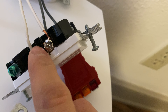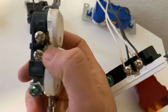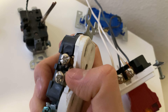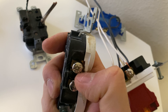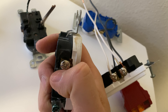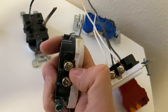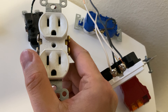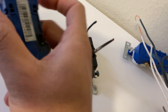When they wire it with the screw and the wiring is screwed on but loose, it will still melt the outlet — you can see it like this. All this plastic gets in the way around the wire because when you load it, it heats up, and when you unload it, it cools off and eventually loses contact with the outlet.